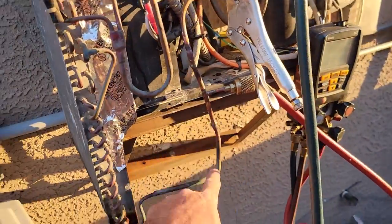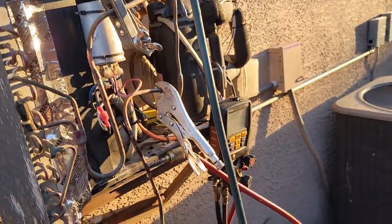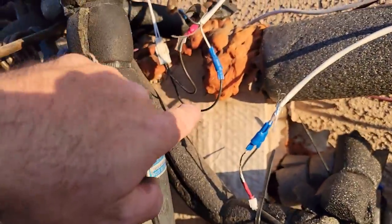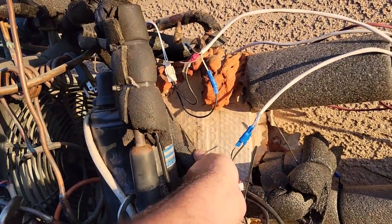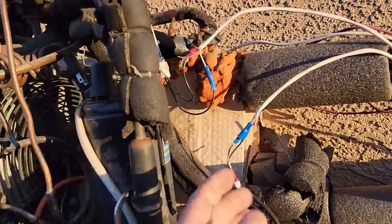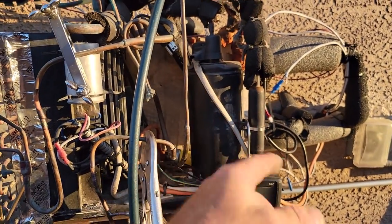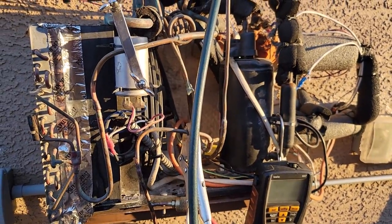Got it on evacuation for this pinched-off section right there. Initially I used to just use the heat exchanger — you can't see it, it's from a water source heat pump. It's a tube-and-tube heat exchanger, all encapsulated in foam, and I reject the hot gas directly into that to heat the water heater. Initially this was made to heat water — this was the evaporator, it still is for winter mode. It rejected heat into the heat exchanger with the circulation pump, and you only heat the water to like 130 or so and everything's great.